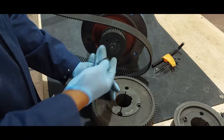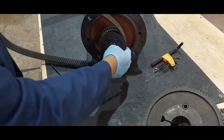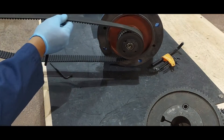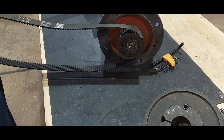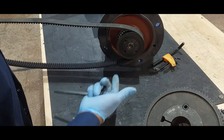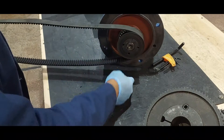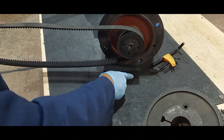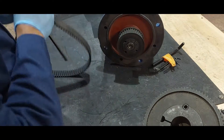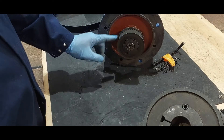This is how it looks when it's on a shaft. Suppose this is an electrical motor — this is a pulley and it's transmitting rotational energy, moving a load. Remember, if we want to change the belt we first have to release the tensioner so that the belt will slack. Once the belt slacks, we can remove it, and if we want to remove the taper lock bush with the sprocket, we proceed accordingly.